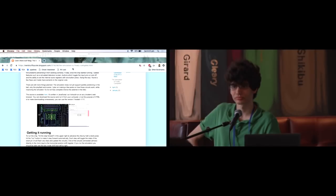More questions? Alexei, you better put your hand up. Yeah, answering Andrew's question, we did the S386 when it was released. Long ago, I was building an SoC on an FPGA, and I only had like 20 or 30 LUTs free, and I wanted to have a video display. So I used LFSR counters that I decoded in the same way. And it's hilarious to see that that was actually how they did that. Thank you very much.